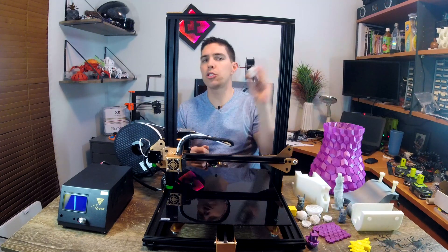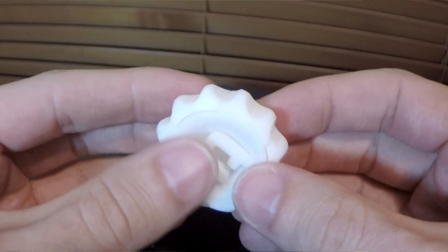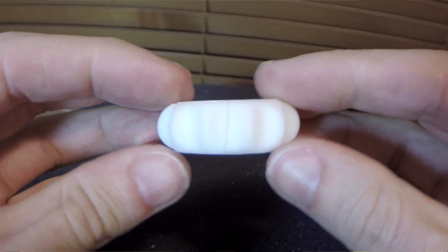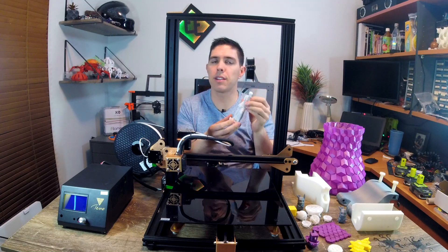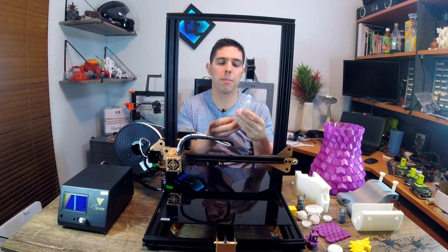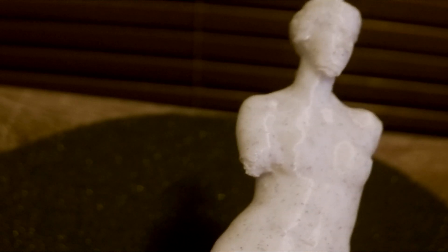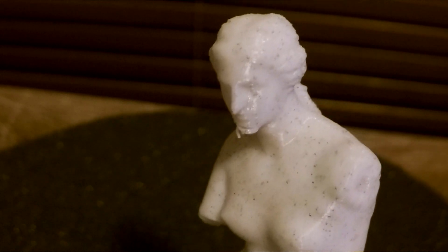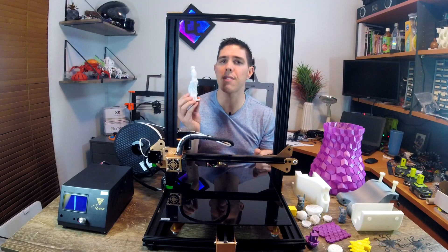Next I did my own two-part maker coin - a great test of accuracy - and the two pieces slotted together pretty much perfectly. Apart from the Prusa Mark III this is probably the best version I've ever had of this print. This is probably my favorite print I've done on this printer and one of my all-time favorites: a Venus de Milo statue done in X3D PLA marble at 0.15mm layer height. The quality is just outstanding - the flecks in the filament hide the layer lines. Apart from a couple of bits hanging down on the chin and underarm where I didn't put any support, it looks almost flawless.